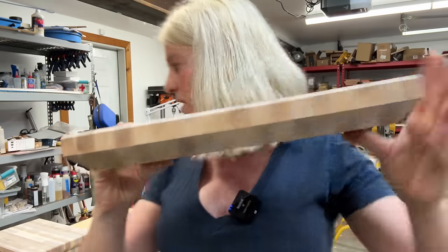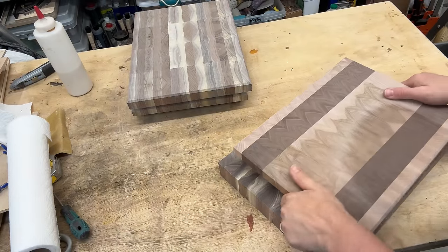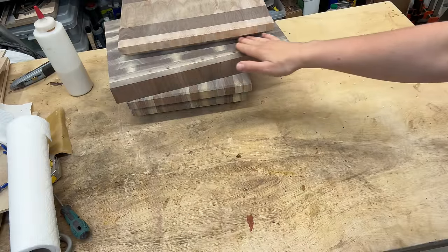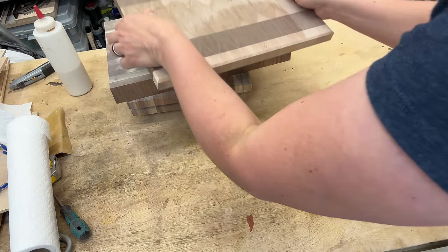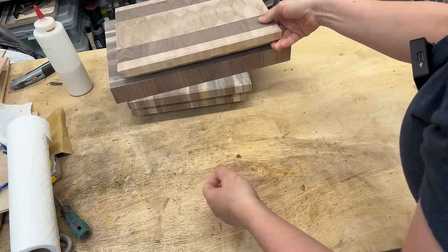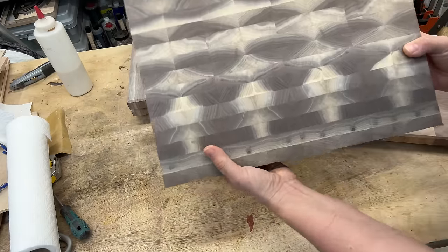For this one I already added the heavy chamfer — let me bring you to the table and show you a couple of things before we add the chamfer to the walnut board. The reason I like adding a chamfer versus a roundover: one, I think it's a more modern look — roundovers are kind of old style. You see it gives it a shadow line. Also, it makes it look so much thinner even though it's a thick heavy board. And the chamfer allows you to hold it with your fingers — you stick your fingers right under there, makes it easy to pick up.